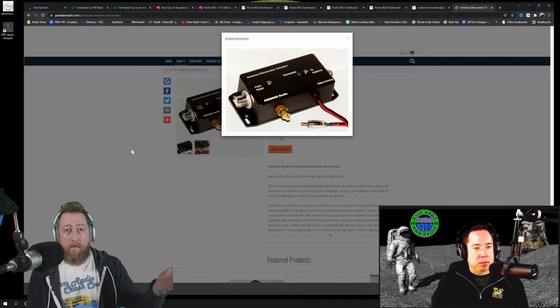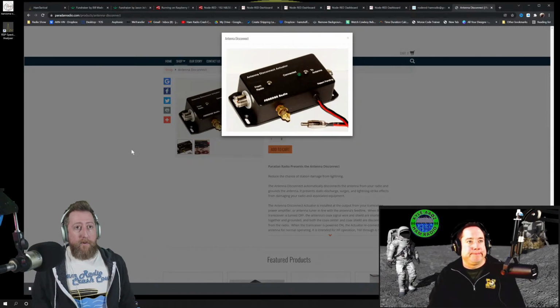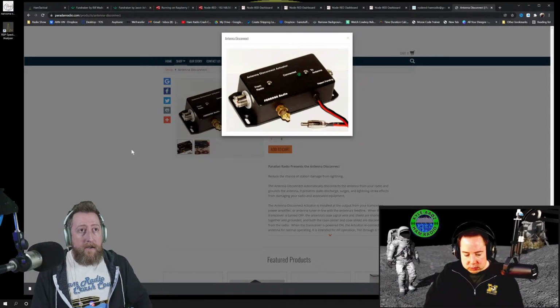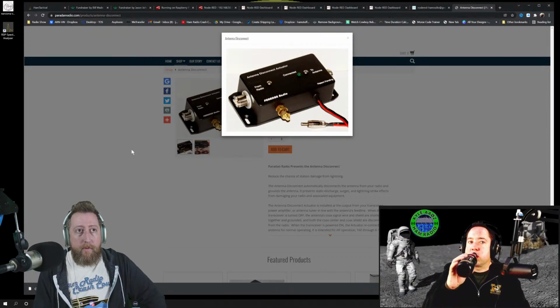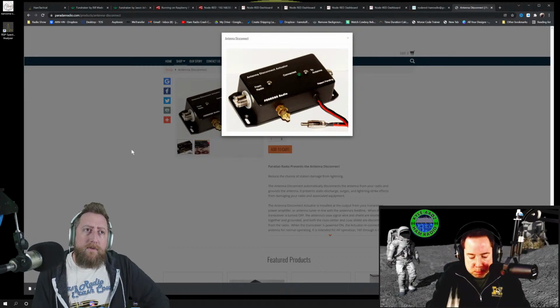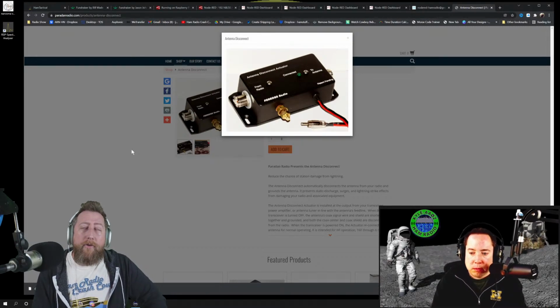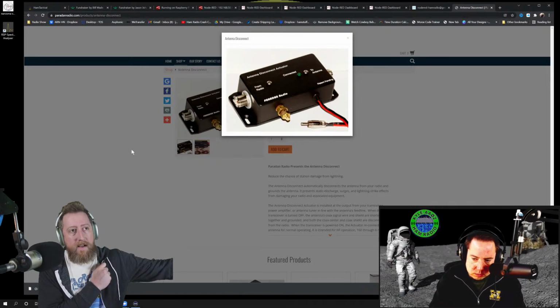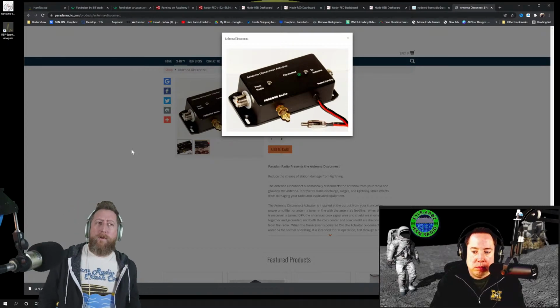A lot of comments. One mention was they make a Raspberry Pi relay hat. Well, shoot, that takes all the guesswork out of it, because then you can just fire that off directly from the Pi, fire it into your box here, and that's just good insurance for your rig, pretty much. So you'd put your ground rod and lightning arrestor on the antenna side of that box, it looks like. That's real cool. That's smart.